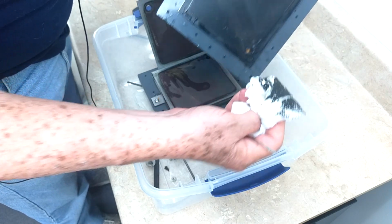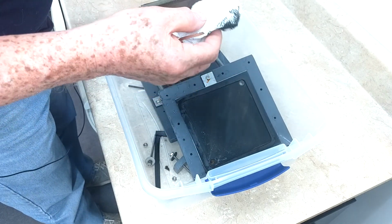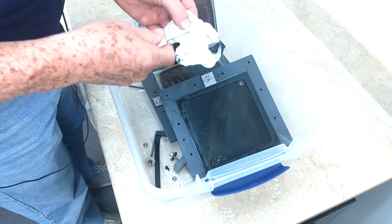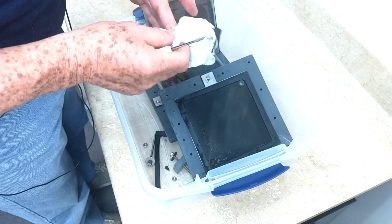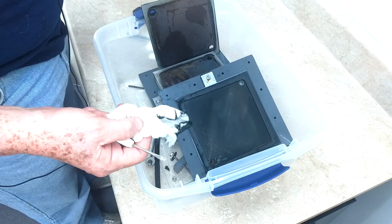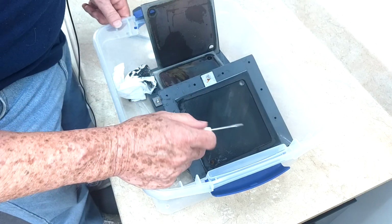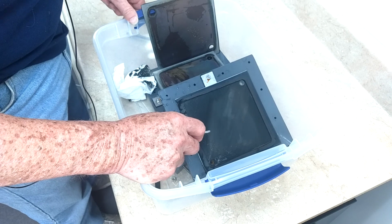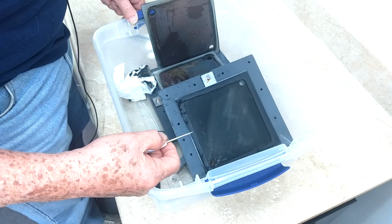So although it was still working, I would say carbon steel plates are good for a limited amount of time. Maybe for just some quick experimenting. So this unit ran for about 3 weeks, 8 hours a day. So there's quite a few hours on it, but it kept messing up all the rest of the equipment. So I think it's time to think about going to stainless steel plates.